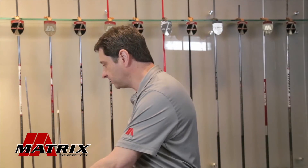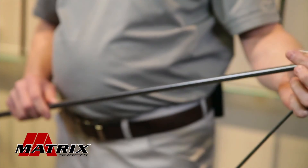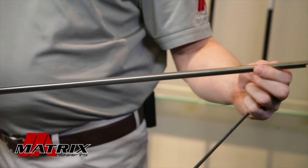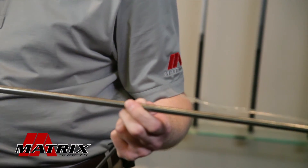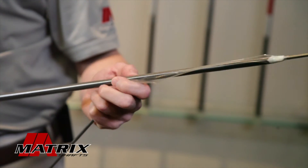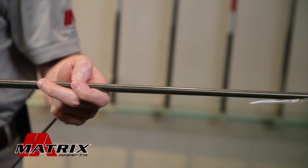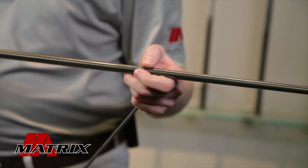And once we're done, we're going to put a cello tape on the outside of the layup. It's going to compress all those flags and apply pressure when we cure the epoxy resin that's in the layup. So there's a small overlap of cello tape material on here, and we're going to put this in the oven to cure the epoxy resin.